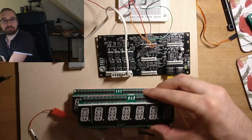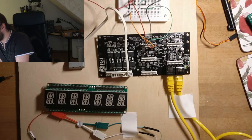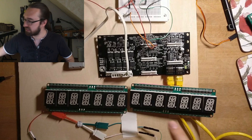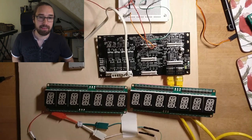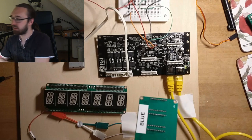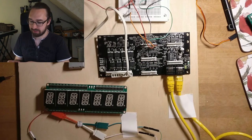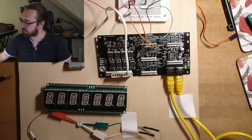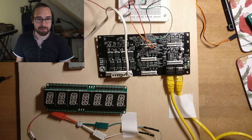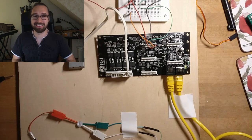I also got some Cobra Pin stuff today including these nice seven-segment displays. Thomas sent me two — one blue and one red. The cool thing about these is that they use WS2811 chips, making them serial LED displays connected by just three wires. They will work on the FAST Nano's LED serial chains — you connect them to the chain port and the Nano can drive these segmented displays. I'm super excited to play with these and I'll show them in a future stream.